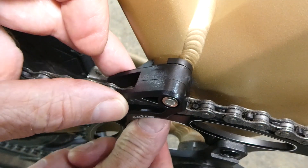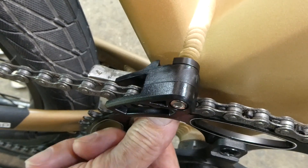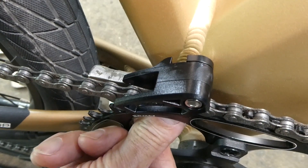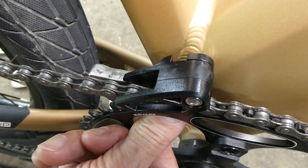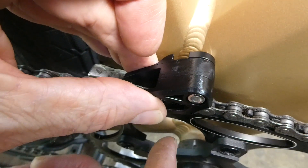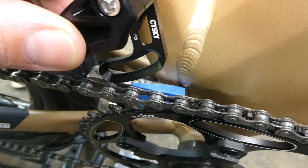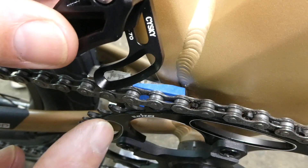Here is the chain guide piece. I think it's going to go right about here — right around there. It might have to be shimmed, but we're really close. Now we're going to have to transfer our holes into that quarter inch plate. That's why the tape is there, so we can scribe a line. And what we're going to do is drill and tap for those screws that came with the kit.